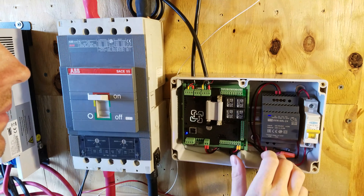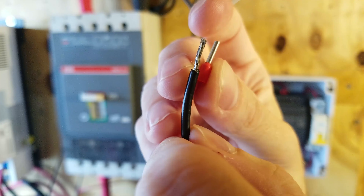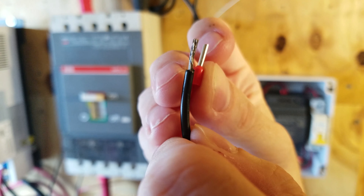Before I was interrupted by the inverter fan, I was saying I'm going to start by shutting off the power to the step-down and the WatchMon — that's currently done with the 10 amp breaker. We're going to connect one lead from the shunt trip to relay 1 on the WatchMon expansion board. Relay 1 is connected to pins 11 and 12 — those are the normally open terminals, and once the relay engages, they will close.